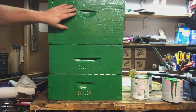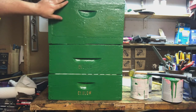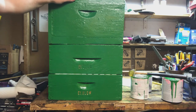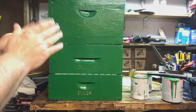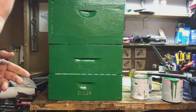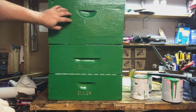We finally are done. Everything is painted. The walls, which had a significant amount of cracking, got quite a few layers of paint. This nice thick stuff that I purchased from Tractor Supply filled in all the cracks, which really is part of our goal, because we don't want moisture to form inside of those cracks and begin the rotting process, or at least reactivate rot that's already there. So enough layers for this makes it fairly water resistant.